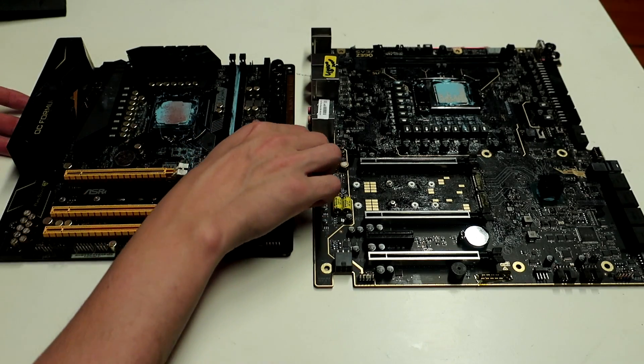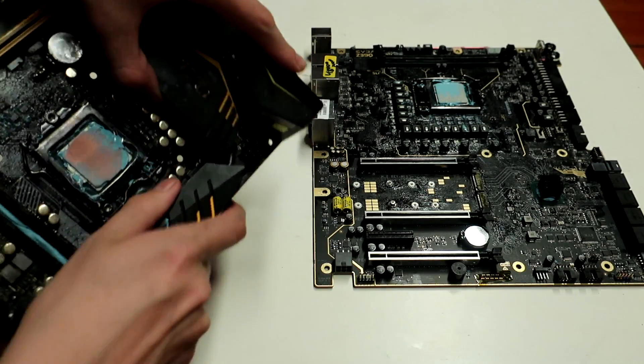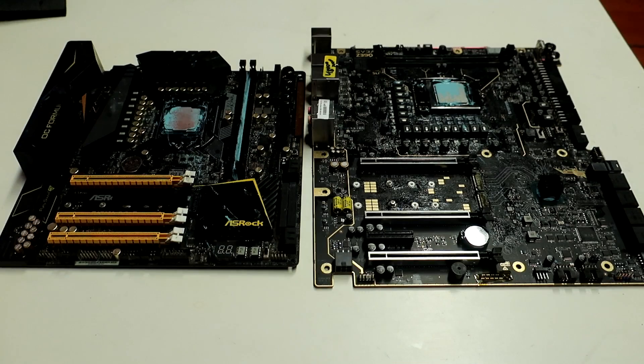I was also having some issues with my power supply, as the old ASRock board only supports a single 8-pin to power the CPU. My Corsair HX1200i — or it could be any modern PSU — has both single and multi-rail mode on paper, but even when set to single rail mode there's a stupid 40 amp current limit per connector. That means I cannot run the best possible multi-core speeds on this board with that PSU, since when I try to run 6.8 to 6.9 gigahertz Cinebench with 1.7V Vcore, the power supply shuts down immediately. That tells us the CPU is already pulling 500 watts at that point, since 40 amps at 12 volts is already 480 watts.